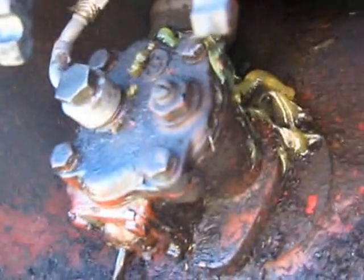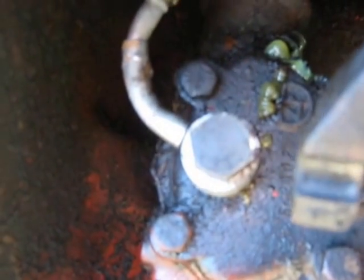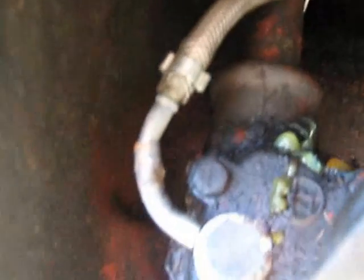I decided that if it was full of grease it would be better — it wouldn't run out. There's a bit of grease up the back there because I pumped too much in, but the top bearing on the steering shaft usually stays dry if you just put oil in, because the oil stays down the bottom where the banjo bolt is — that's where the level plug was. So the top bearing gets no oil, so I put this pipe on.